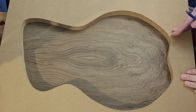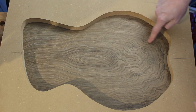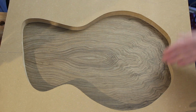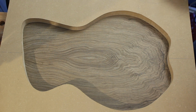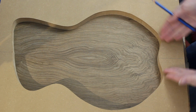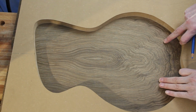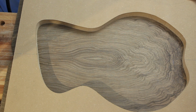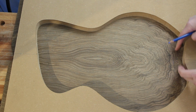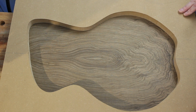Decisions. I've made a mark there. At this point we have grain lines coming down and nicely coming around and echoing the edge of the guitar, so it creates a nice aesthetic. If we move up, then the grain lines are coming down and they're just ending at the end of the guitar, they're not scooping round, so it doesn't look quite as good. But any further, and it doesn't really affect the look, it's just adding more of this potentially badly behaved grain. So I think by putting the end there is a slight compromise, but I think a good one.